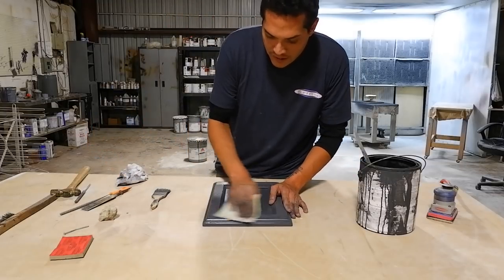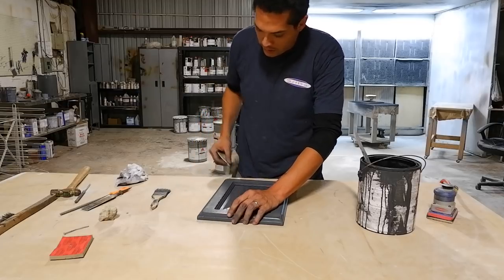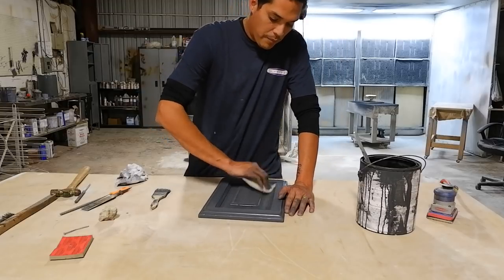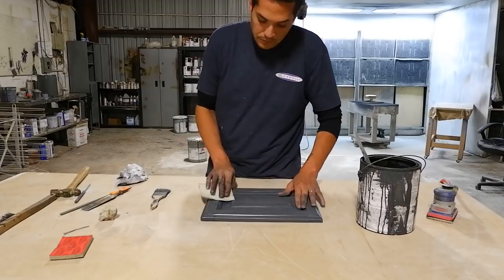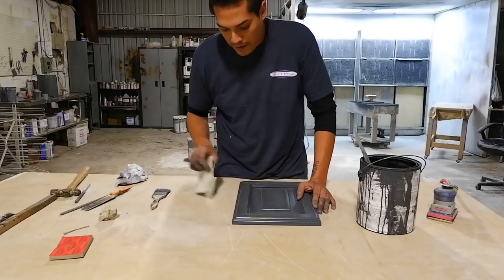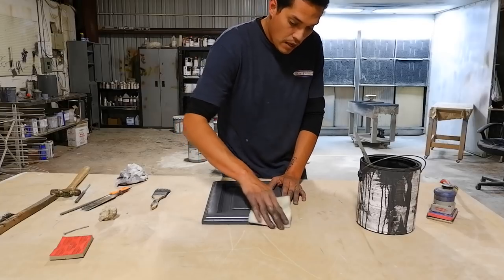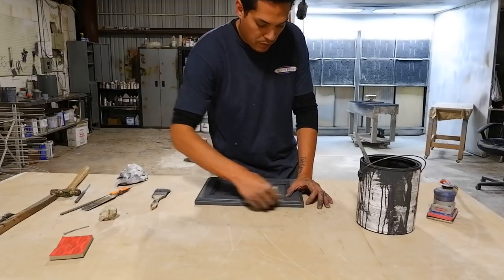Once I start applying that powder glaze, I'll come in a little bit closer with the camera so you can actually see the application process. The way I'm going to do it today — I do spray powder glaze a lot, but I'm going to put it on with a brush. A lot of people have asked me if the product can be brushed — yes, absolutely the product can be brushed. It's a water-based product and it's fairly easy to work with. It might take you a couple of times. I see a lot of folks have struggled with it when using different types of products, not necessarily industrial wood coatings — my guess is you probably need to let that coating dry a little bit better, or maybe it's not the best product to use.